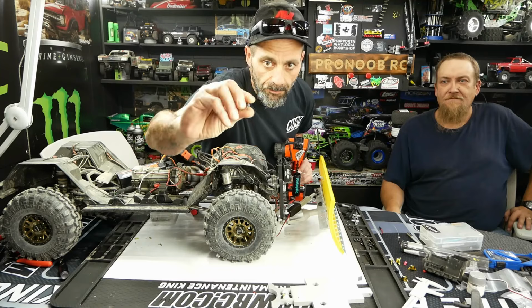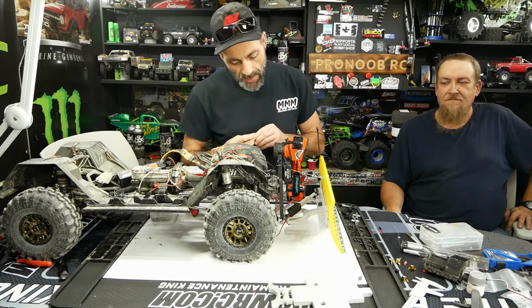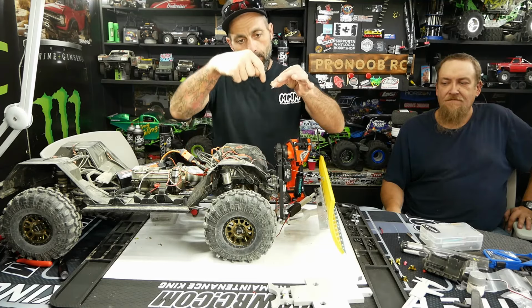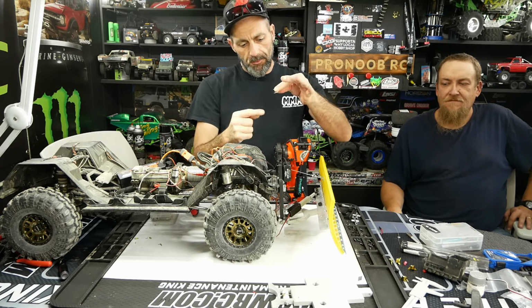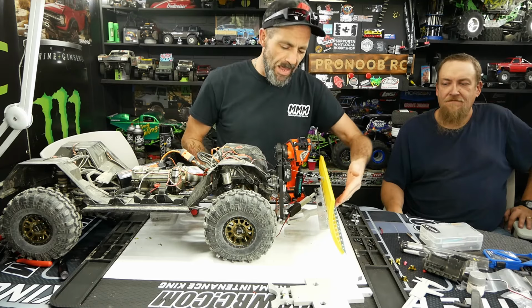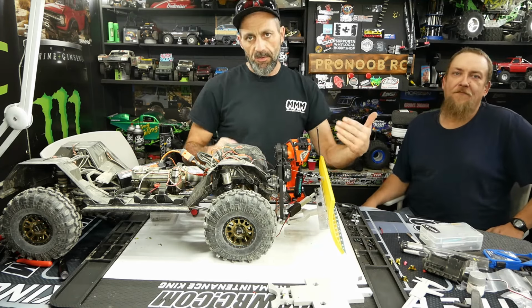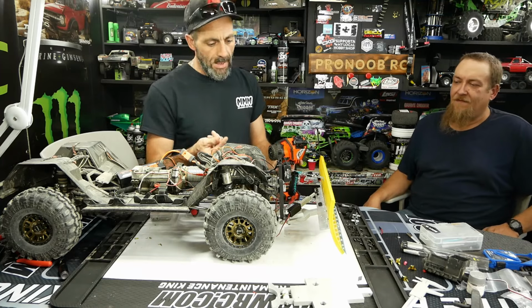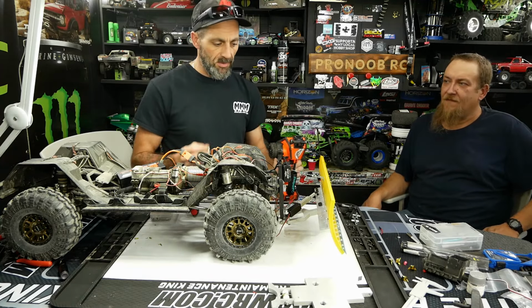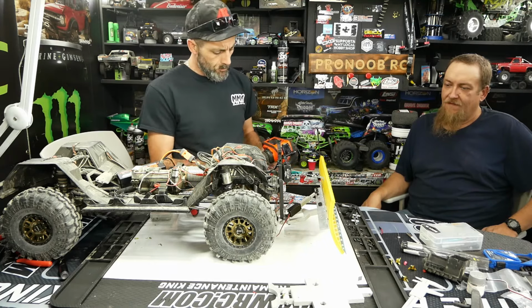They're a little U-shaped with three holes drilled in them. We're going to put two on each side of the back of the plow with a bolt running through with the head on the bottom, with a spacer. That allows us to keep the edge of the blade off of the bad stuff, the concrete, the gravel, the rocks, whatever you're going to chip and break it on. They just run on those metal bits until you're into the snow and the plow plows the snow.